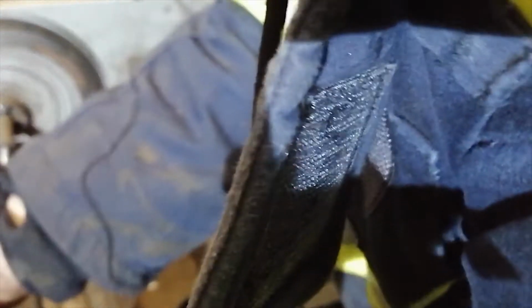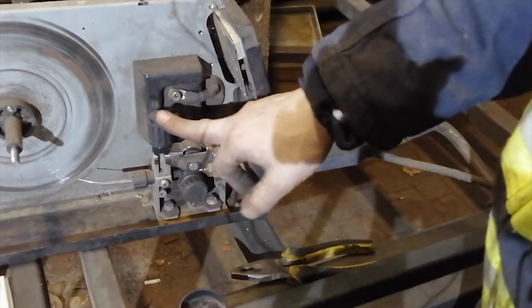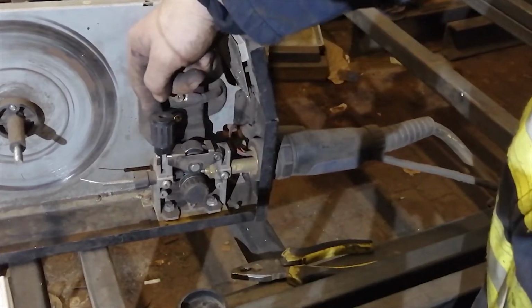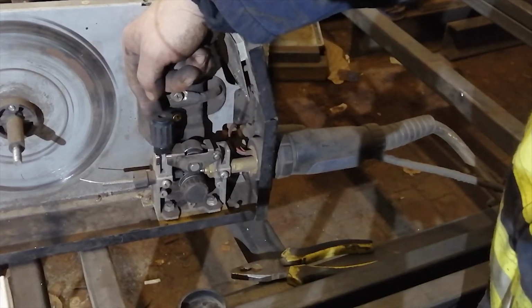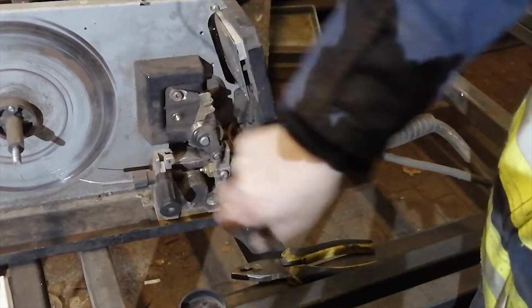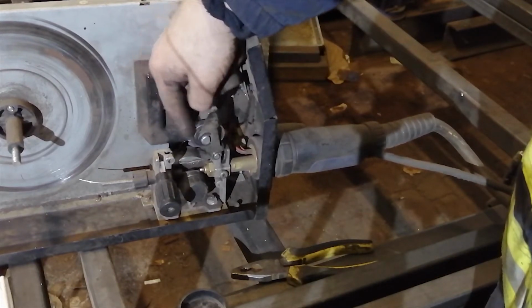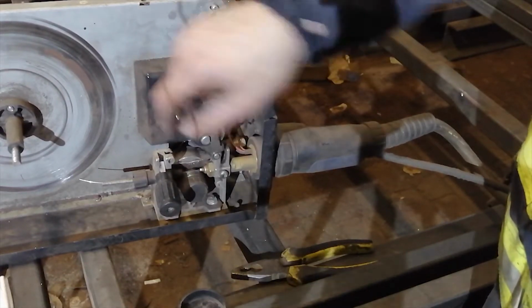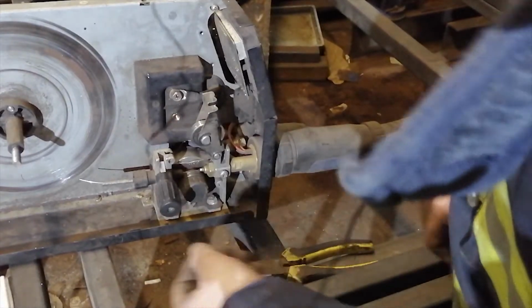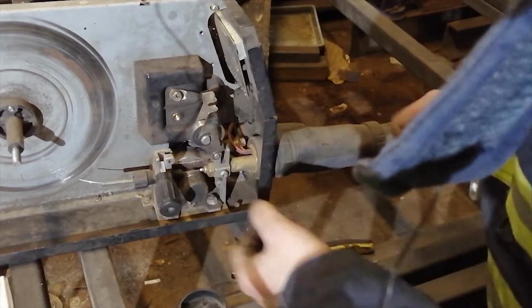Just a minute. First we prepare the welding machine. We see here there's a mechanism which tightens the welding wire. We just push, and as you see here, it opens a bearing roller which feeds the wire, and on the bottom is a second one, and the wire comes exactly inside.